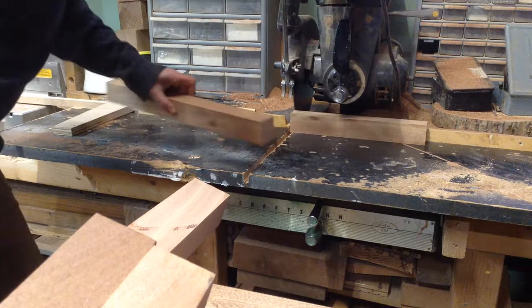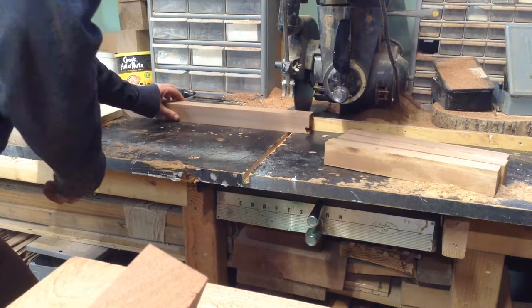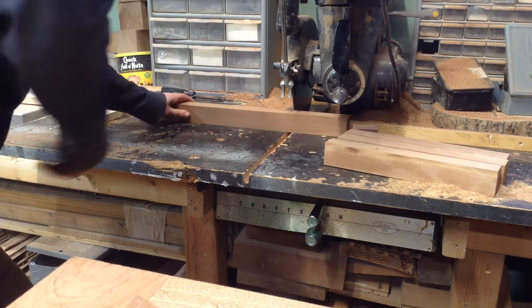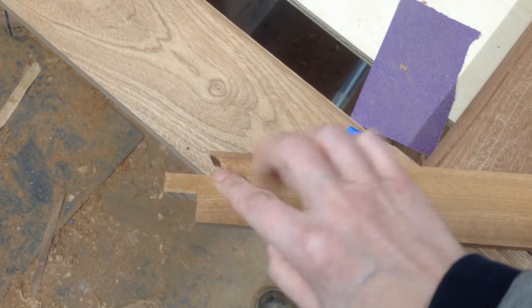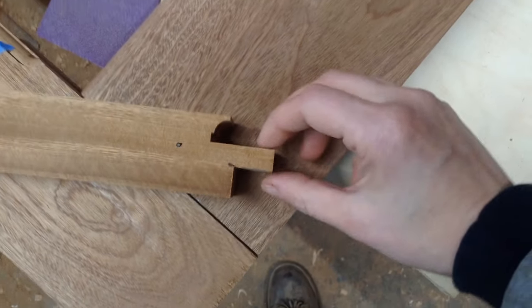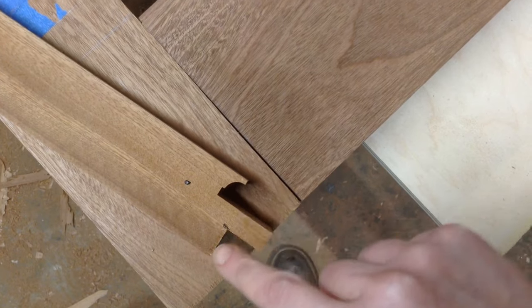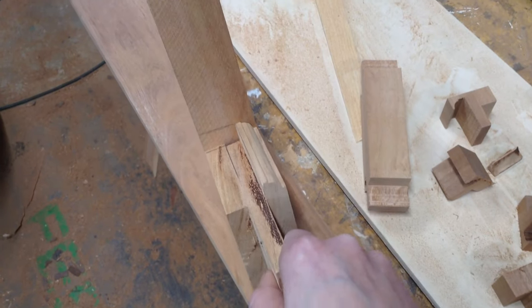This is a process — I had to set up a lot of tools to get all these profiles, so all the pieces I'm cutting off are going to be test pieces, and I used most of them in this process. I set up all my tools to cope that one edge and got it just about perfect. The rabbet worked out nicely, but when I went to lay it on the piece, the 18 inches I cut was a little too long. You can see all the different math — how the cope side, the rabbet side, and the mortise are all different lengths. There's my pile of rejects, and then I finally got it perfect — this is my test piece, and you're going to be using this throughout the whole process.